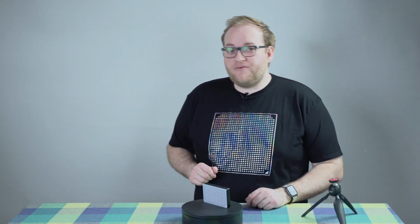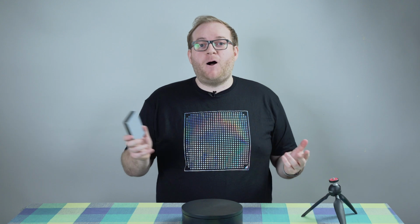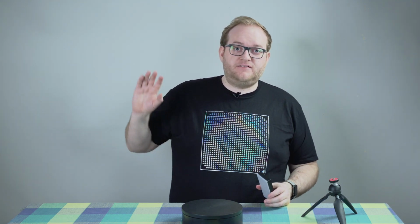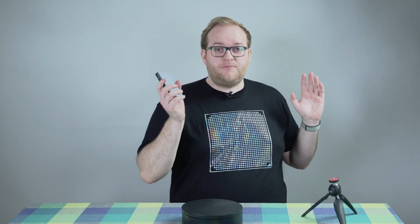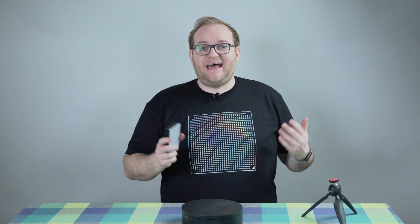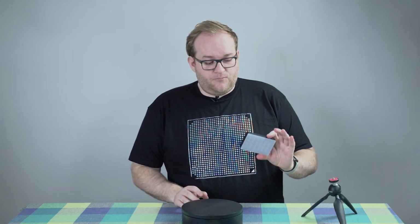So the first video of the series that we're jumping into is about the Viltrox RB08. The RB08 is a bi-color LED light. Now I've actually done a huge video on bi-color video lights, so check that out above. But basically what that means is you can change the color temperature. Actually, what's really interesting about this is the color temperature that you can change it to is really wide, all the way from about 2300 Kelvin to 8500 Kelvin, though I usually use it at daylight, which is 5600 Kelvin, and I'd probably recommend it. But it basically allows you to match the light around you with this panel light.